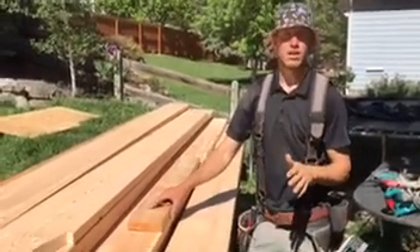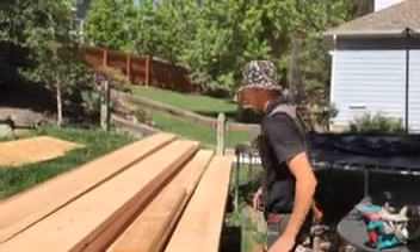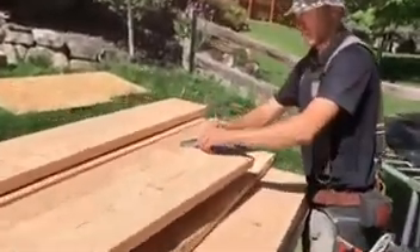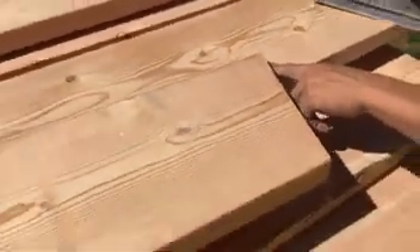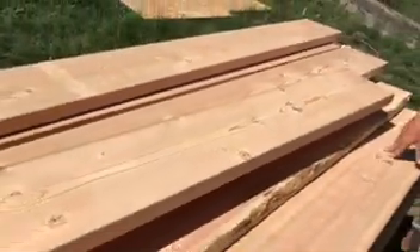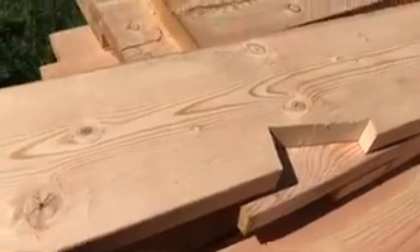What we do then is go and cut a demo one that we can use as basically a tracer board, which is what I did here. You take that 14.8 degrees and scribe that onto the side of the rafter using your speed square. Put your speed square down on there, get it lined up with 14.8 degrees — as you can see here. You're going to trace that, make that cut, and then from your long point — which would be the top of your ridge — you're going to pull down that hypotenuse number, which in our case was 121 and 5/16 inches. Pull that, make a mark on your board, and then square down at that same angle.